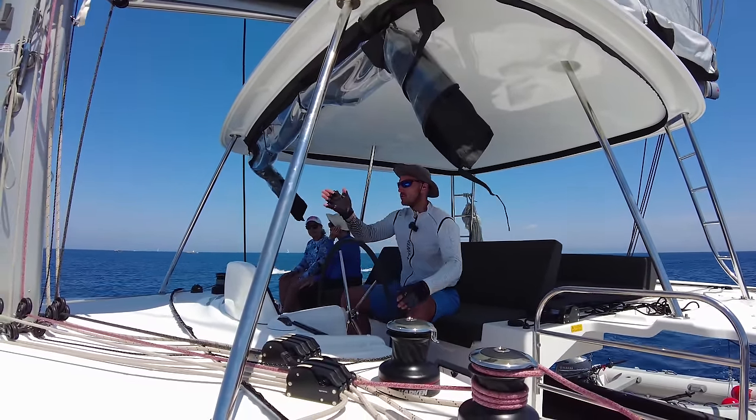So this just produces way more movement. And if you look at how this boat is made, the anchor is attached all the way in front. You see, so the pivoting point is all the way in front. Like that boat has it here. You see, so it's a totally different leverage, and this is much better. And we keep the Y. But then again, you can see now this boat is turning like crazy. If it was designed like our boat, having the anchor all the way in the front, the boat would be moving much less.